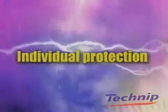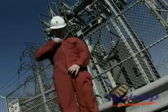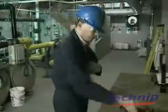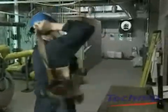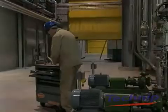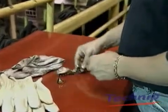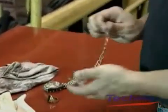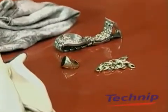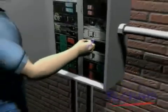Individual protection. Protect yourself by wearing the appropriate clothing. You should always wear non-flammable work clothes that are rated for the hazard. Always wear safety shoes with insulated soles and heels. Never wear a tie or a scarf. Remove all metal jewelry, rings and watches, since gold and silver are very good conductors. In the case of a short circuit caused by jewelry, an electric arc may be formed with fatal results.